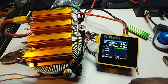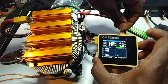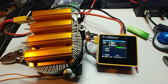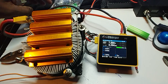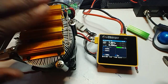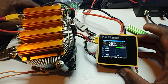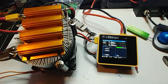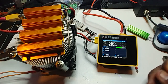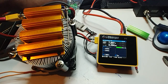That's it — nothing really to it other than trying to figure out how to keep these things cool. Let me go ahead and stop this. The charger was set at 30 and all I did was add or remove resistors and you saw where the amperage went. These things get smoking hot, so there you go — quick video on what they were talking about as far as adding resistance. I've yet to figure out the one-cell pack because you've got to have the balance lead in, and every time I go to do this the balance port turns off — something I'm not figuring out on the one cell, which is what I really wanted to do because of the 1/12-scale stuff. Anyway, thanks.